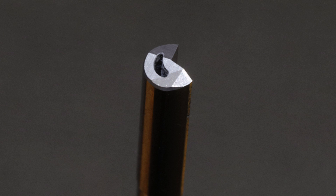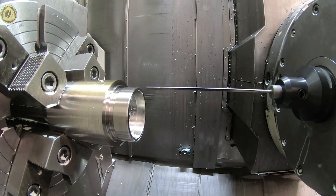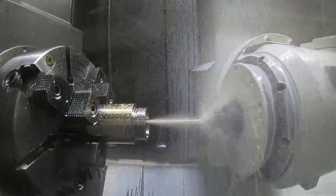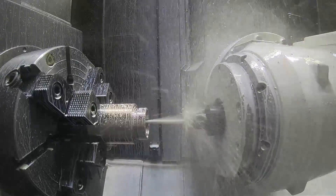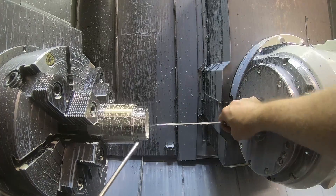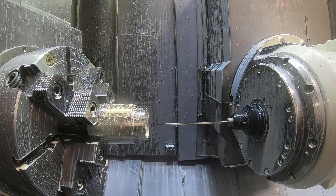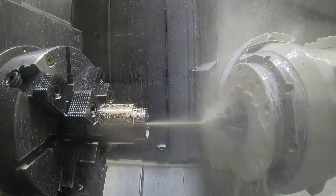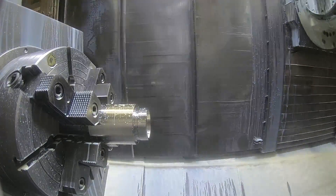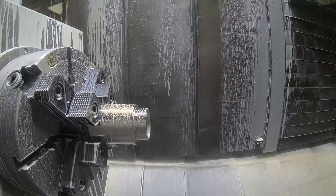That's the new drill — that's what it should look like. I'm going to finish the hole down to depth. It's going about three and three-eighths deep into the part. I'm going to stop it and check it to make sure it didn't get damaged finishing that hole. It looked alright, so I'm going to run it on the next hole. And then we come in with a flat tip gun drill just to flat bottom those holes so they match the flat surface of the bottom of the pocket.